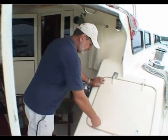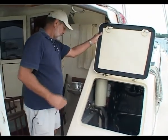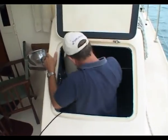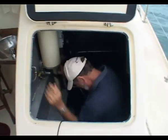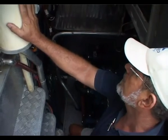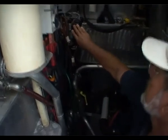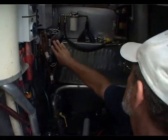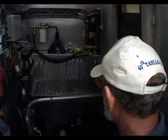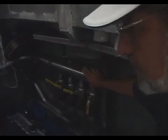The engine rooms are aft, through this hatch here either side. They're quite spacious. What we have here is the NAF S3 fire system. Going forward we have the solenoid bank for the hydraulic winches. Further across we have the hydraulic pump which drops down into the hydraulic tank. It feeds a manifold to each compartment — a 40mm pump. It's all to New South Wales Waterway Survey.